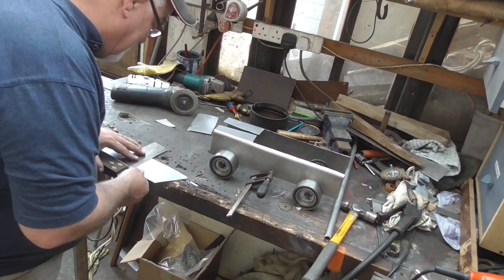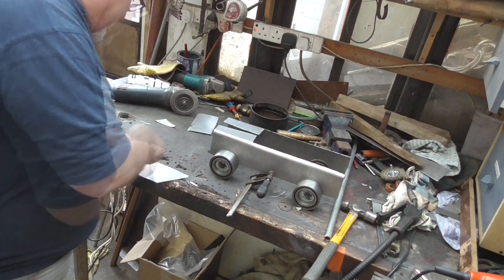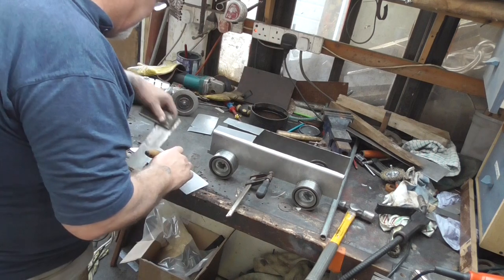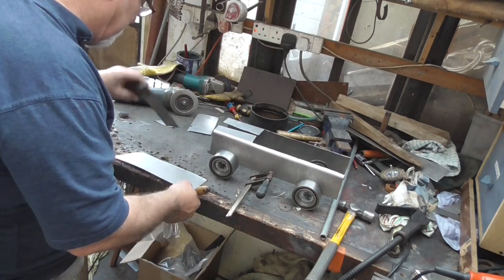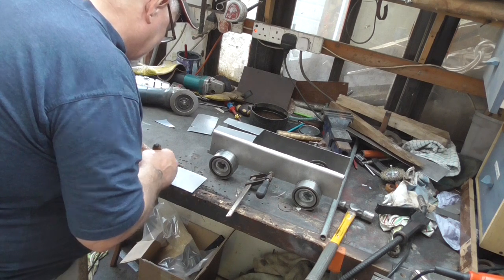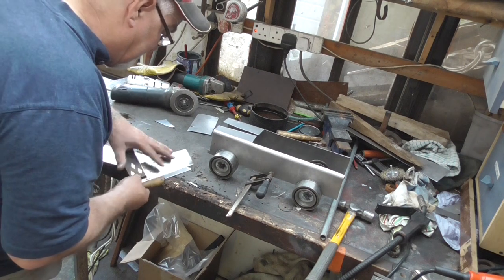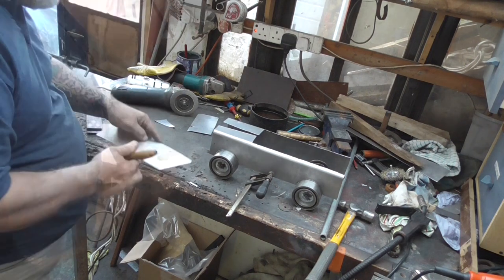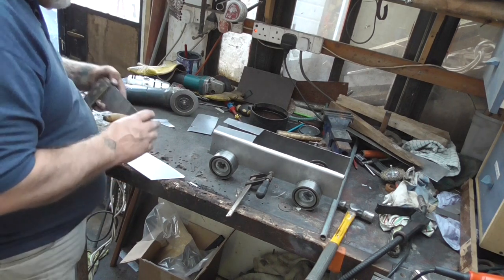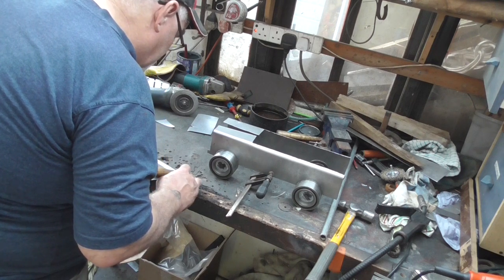We're going to do the same as we did last summer. I'm going to scribe a door in it. That's close. So we'll go there. Hope I'm not boring you, because I'm doing this nice and light. We're going to cut it out with a saw. That's going to be welded on an eighth, so come up a quarter at least. So eighth and a quarter is 3/8. That'll be there.